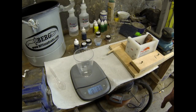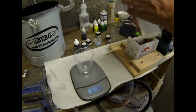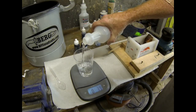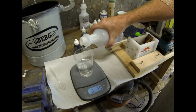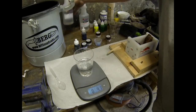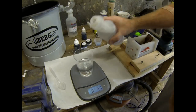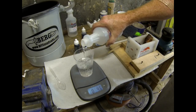One of the most important parts of mixing and getting a good result with Alumilite is to accurately measure — it has to be equal halves. What I did was put a clear container on my digital scale and zeroed it out with the container in place so that I'm only weighing the actual fluid from Part A and from Part B. Whatever the weight is on one half, you want to match that when adding Part B.